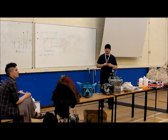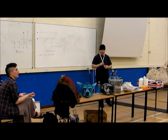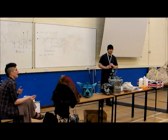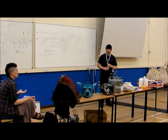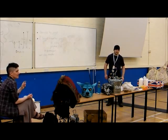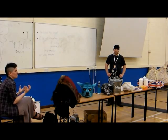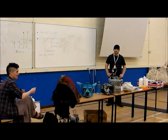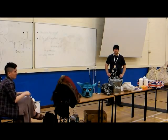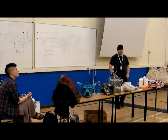For example, if you wanted to mass produce claws for a fursuit, if you make a solid master out of polymer clay or wood, Milliput, modelling putty, whatever, then you can make a mould, take the claw out, make another mould, take the claw out, get 10 moulds, so that when you actually come to cast a batch of claws, you mix up one batch of silicone, or rather, resin. Loads of it, sorry, resin. You can cast found objects.